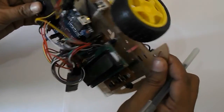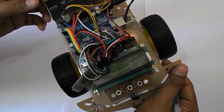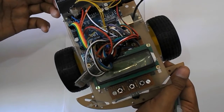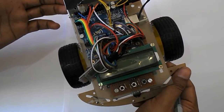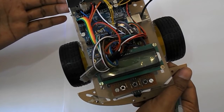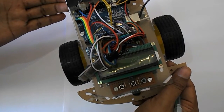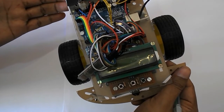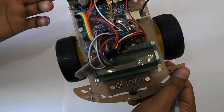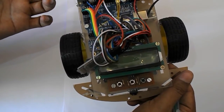Regarding how this robot runs within the maze: I am using two PID controllers. One PID controller controls the distance from the left side wall, because this robot works on the left-hand on the wall concept. The second PID controller controls the angle of turns — ensuring the robot takes neither more nor less than the adequate angle while turning.